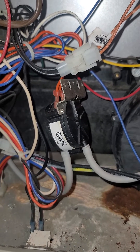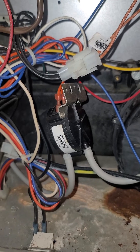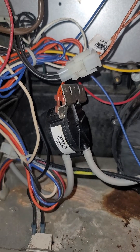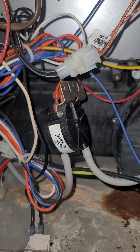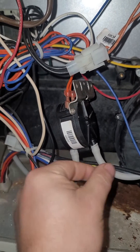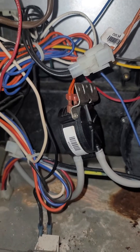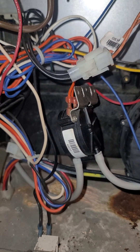I've been having some problems with this issue with this furnace and air conditioner. So what I did was I unhooked these two, kept these connected, and jumped the furnace — jumped the pressure switch — and got it going.